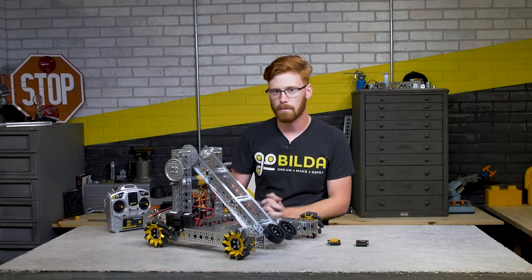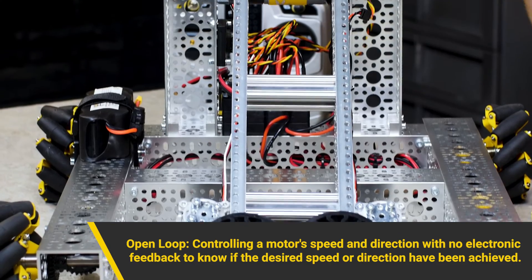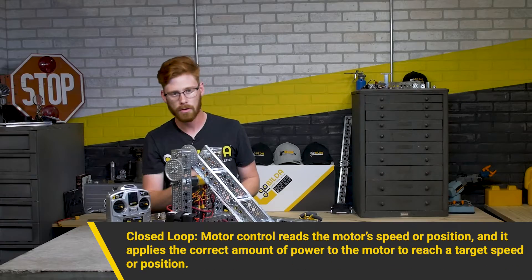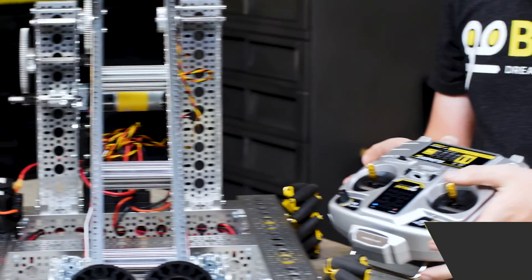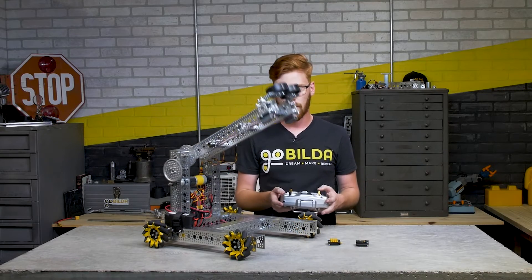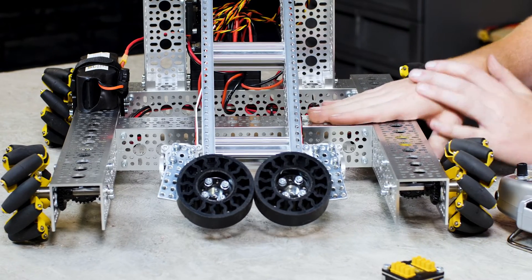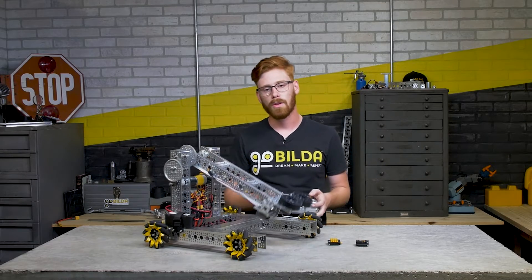Because these motor controllers are simple speed controllers, they are open-loop controllers - you control the speed and direction, which is not as ideal for controlling an arm. You can certainly get into more complex motor controllers that allow closed-loop control using the motor's encoders, letting you run to specific positions, but that's outside the scope of today's video. The arm motor is on channel 3, so you can push it up and it applies power to spin the arm - but you could overextend it. If you have a chassis like this, make sure not to leave motor power applied when the motor is against the end stop of the system. You have to be careful driving an arm or linear slide with an open-loop control system.